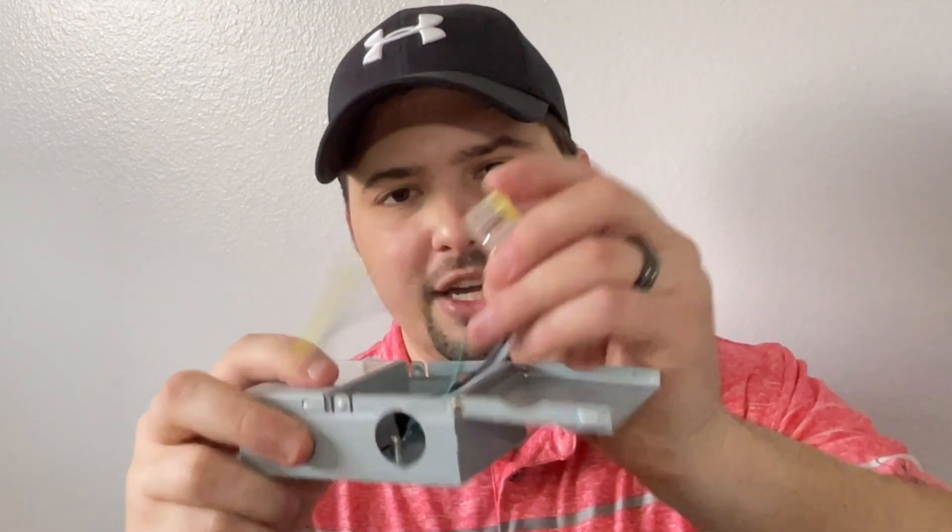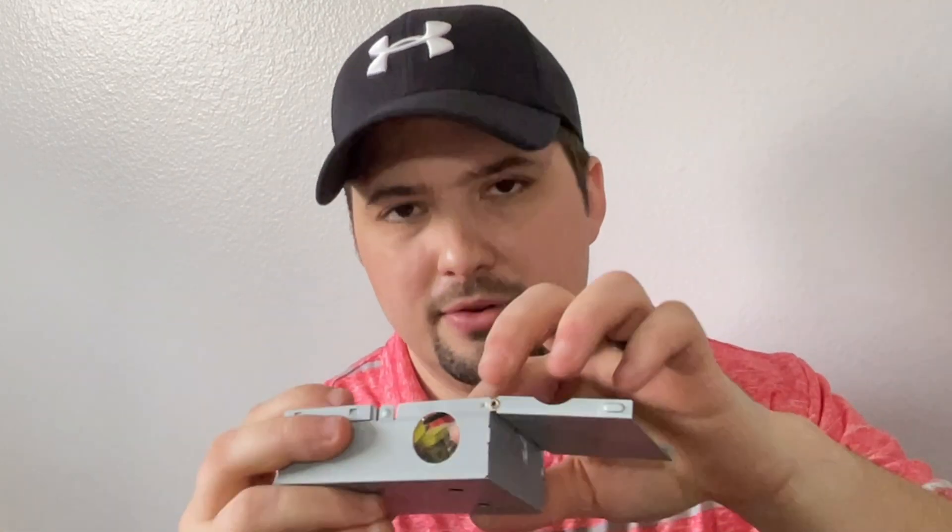The corrected process is: first, do your knockout; then install one of these connectors — I'll use the plastic push-in connector since it just pushes in with minimal effort. After that, cut the sheathing and strip your wires, then thread them through the connector into the box, make your connections, and call it a day. That is the step that is so important and that everyone keeps commenting about.